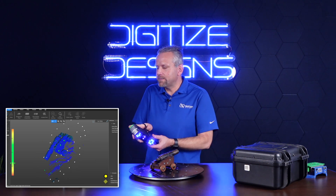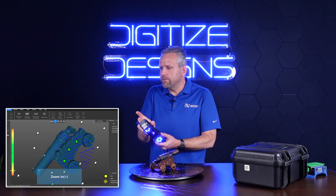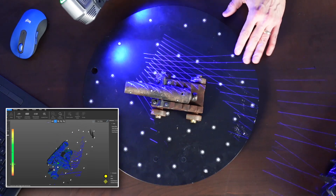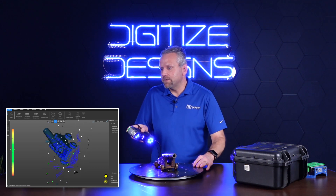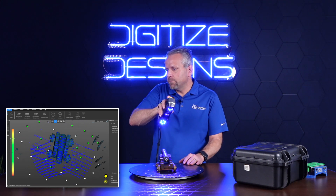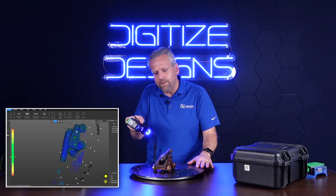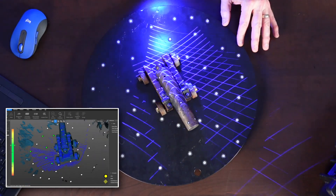You see it coming in. I can at any time zoom in or out with the buttons on the scanner — there are different modes and it defaults to zoom mode. This scanner can scan up to 2.8 million points per second, so you can move pretty quickly. I like to do it in one orientation, moving my hand a little and spinning it around, then changing angles. Remember, this is all line of sight — both cameras have to see the lasers bounce off an area. This is actually scanning really well right here already.